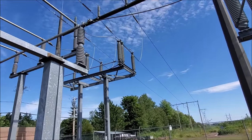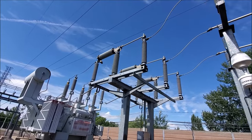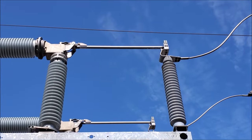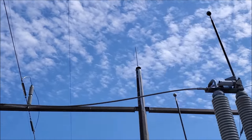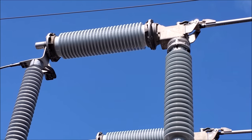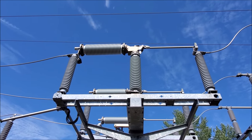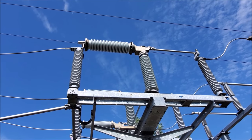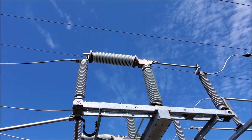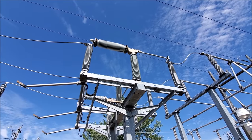Now I mentioned earlier about that disconnect switch — that it can't be operated under load — so how do we shed the load in order to operate that switch? To drop the load we have a second disconnect switch. This one is actually called a circuit breaker. Now there are two switching devices on this breaker. This one here is your visual switch, which opens much the same as the other guys. But we have this second insulator here which is actually a hollow tube filled with sulfur hexafluoride gas — SF6 gas. The reason it's filled with that gas is it's an extremely heavy gas, much more dense than oxygen or nitrogen. So as the device disconnects inside that tube, the arc will begin to form. The heavy gas inside will actually snuff out the arc, and then the blade opens to give us a visual disconnect showing us that this has actually disconnected itself from the line.